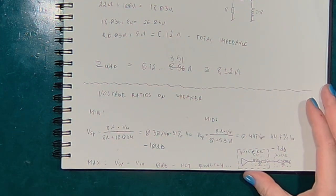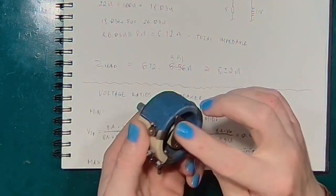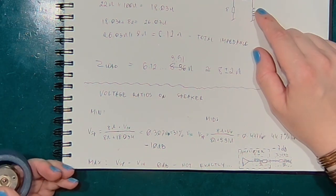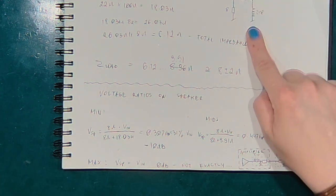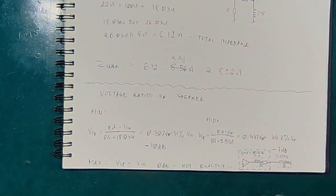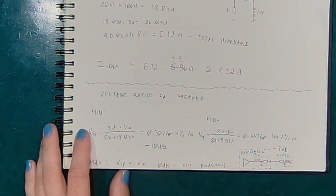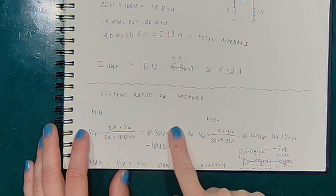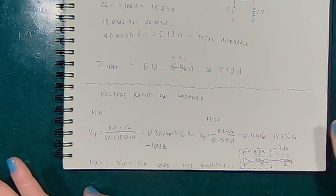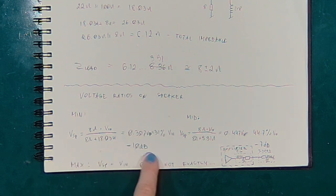And what can we say about the influence of the slider position on the voltage? Let's take the minimum, when the slider is on the resistor side rather than the speaker side. And that would place the highest resistance in line with the speaker, and we get most attenuation. And the voltage on the speaker would be about 31% of the input voltage. So that would be 10 dB attenuation,